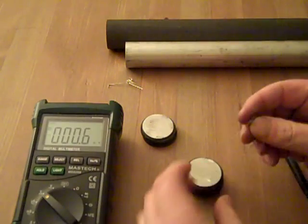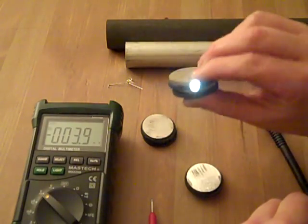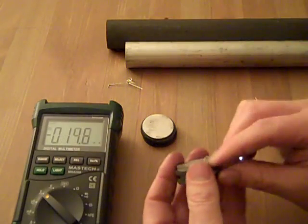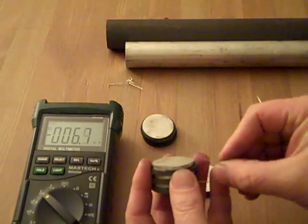I've got some fairly efficient LEDs that I got from Digi-Key. There's a white LED just running on a stack of 2 — that's about 2.7 volts and it's still pretty bright. And then obviously the more of them you get, the brighter it gets.